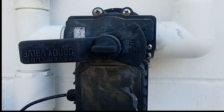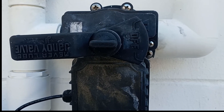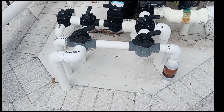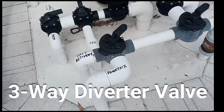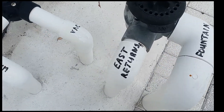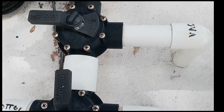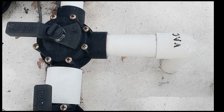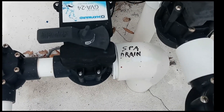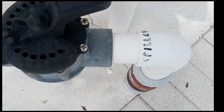If you need to redirect the water flow, simply flick the switch and it's done for you. This can save a lot of time and frustration — it's really a simple set-it-and-forget-it piece of equipment. The next type of valve is called a three-way valve. It's very similar to a two-way valve, but gives you a little more flexibility. A three-way valve has one inlet and two outlets, letting you partially or fully close off one end while allowing the other two ports to remain open.